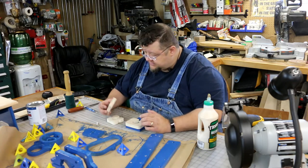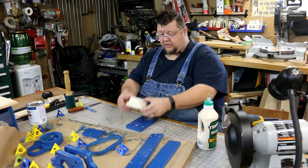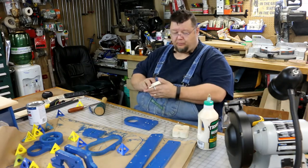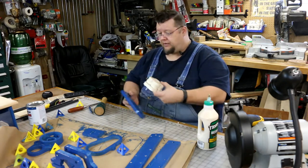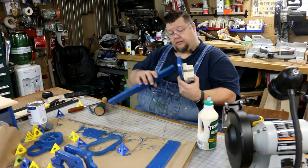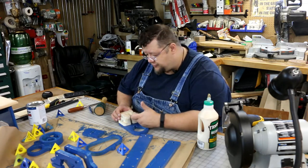All I have to do at this point is take these two pieces that I cut and line them up like so. Then basically I'll glue that together as a solid unit. I'll have the right height and a place where I can screw right through the top. The plan is to have these glued on top with a clearance pocket for the screw hole, then go down through the top, screwing the motor mount with a slightly longer screw, right down into the side — all one solid block. This gap allows me to line the motor and get a screwdriver in to tighten up the coupling.